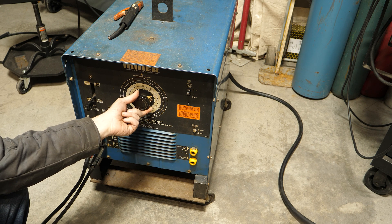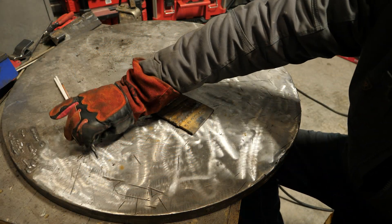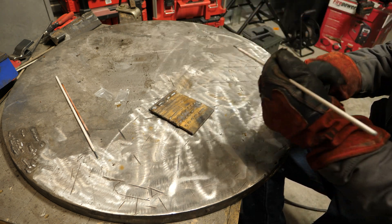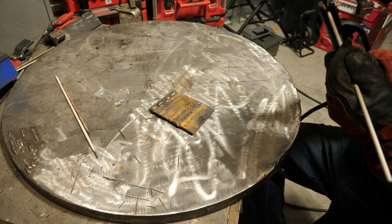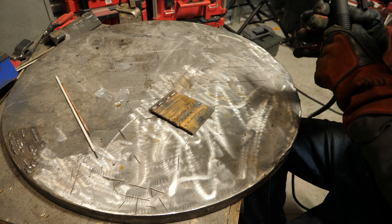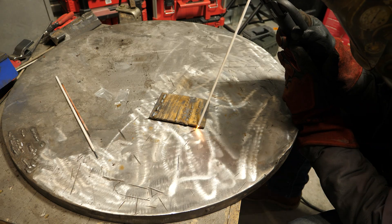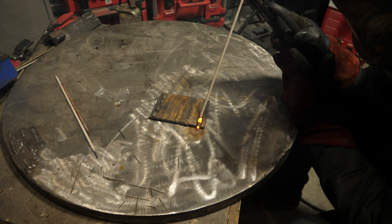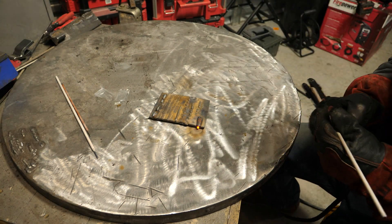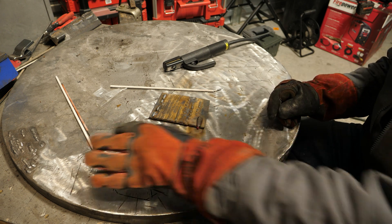Let's put it at welding amperage — 120 amps. I've got a piece of scrap right here, machine set for 120 amps, and we're going to run a 7018 pass and see what it looks like. And... it killed the breaker. Not too unsurprising — at least I had a good run while it was going.